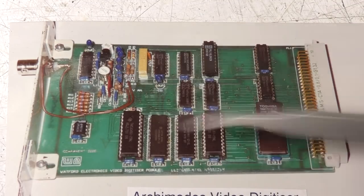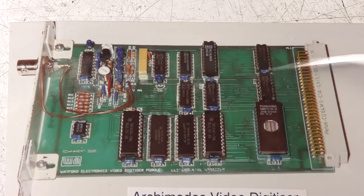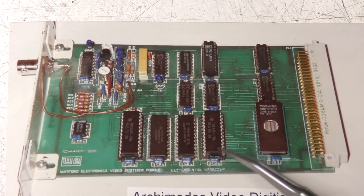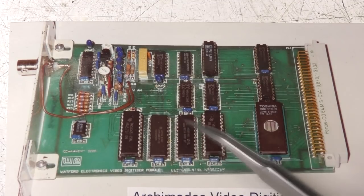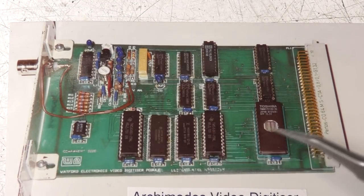And then once that grab had taken place, the processor could then read the data out from this RAM at its leisure. I think this was 512 by 256 pixels, 6 bits per pixel. Each of these held 4 bits, so on 2 of these chips only 2 bits were used. The ROM here just controlled the software.